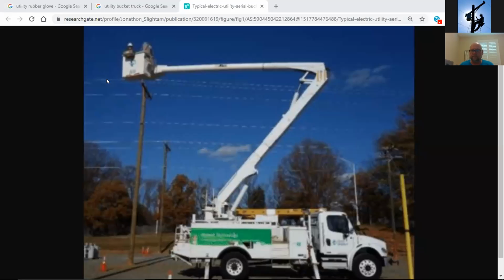No. Why not? Because that'd be a stupid decision. Well, that's part of a good answer, yeah. No truck manufacturer, even if you bring it off the lot brand new, from the service center, you just brought it from Altec, it's an Altec bucket truck. They're going to have right in the front page, this aerial device is not to be used as an insulated device. It's kind of weird. They will not stake your life, putting down a warranty to say that any of the insulation in this boom will be an insulator between you touching a conductor and ground.